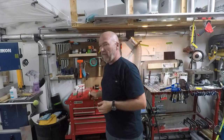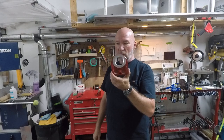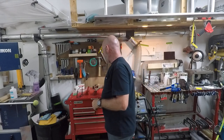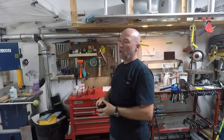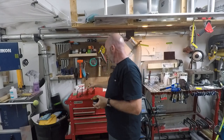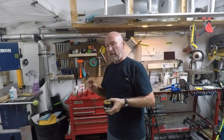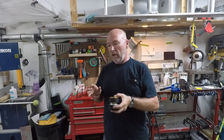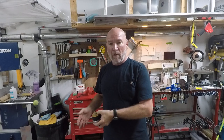What we realized was they were sending the engine out with an older-style Type 1 mounting ear, and it does not go on a Type 2 dynafocal mounting bracket. They finally sent us the Type 2. Now we've got the right ears to match up to the mounting bracket — we think we're getting somewhere — but then we find out we're not sure what isolator we need to use with this Type 2, because anytime you call Aircraft Spruce, Chief, anybody, and you say you want to order an isolator, they ask what plane it is.